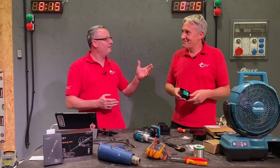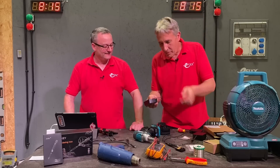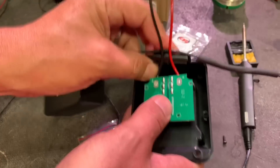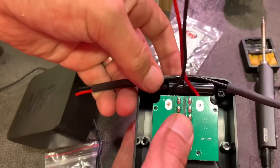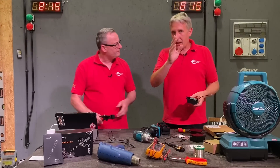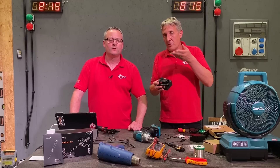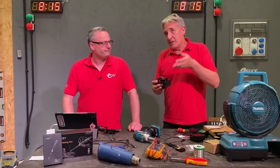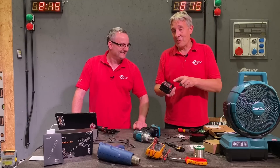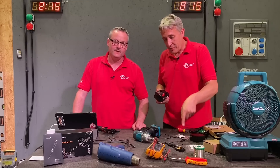Once you've gone through the process, you can probably think of a better way of doing it. Now realising there's not actually much inside the box, I could probably take the wires straight in and smuggle the fuse holder in underneath — it'd look a much tidier job and you'd only have to take the cover off if you did short-circuit the battery. On the Milwaukee battery datasheet there are conflicting things: it says it's got overcurrent protection and will shut down if you draw too much current, but it also says don't short-circuit the terminals. If there are any Milwaukee battery experts who've dismantled one, fire a comment below about whether there's actually protection in there and whether we could omit that fuse.